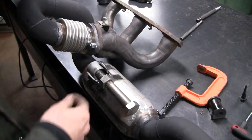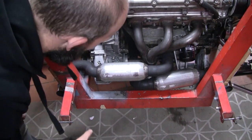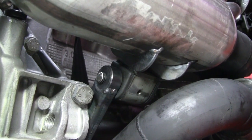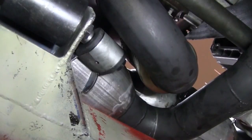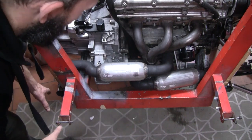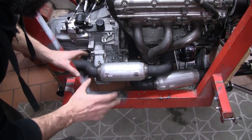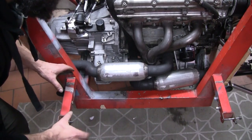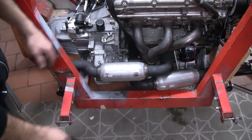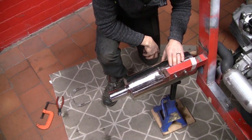I bought one. Now, I know it doesn't look like I've accomplished much, but that was sort of the point. The two mounts are in, both nicely hidden and supporting the exhaust really nicely. The exhaust is sitting there now in the right spot without the mufflers, which is a good sign because it means that the mufflers aren't going to be supporting the rest of the exhaust. It'll just be supporting their own weight.